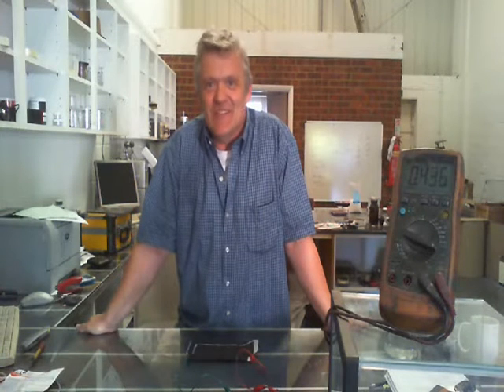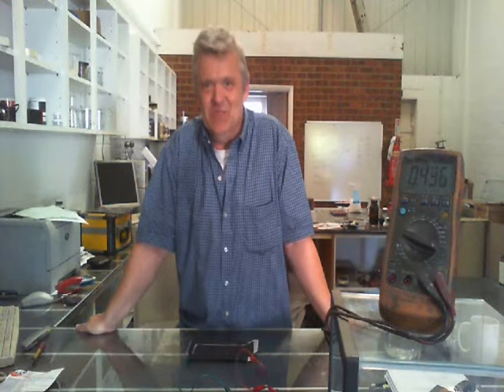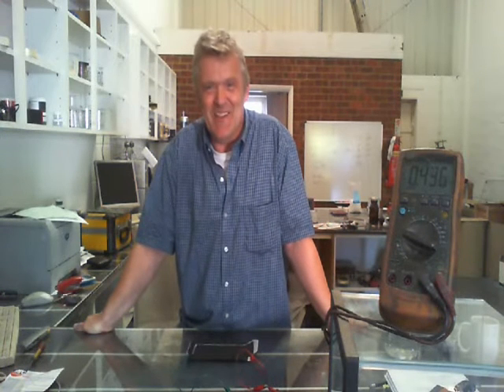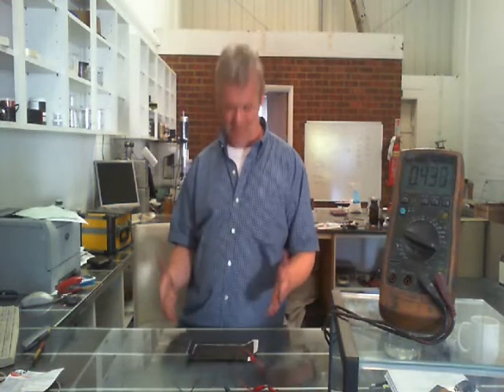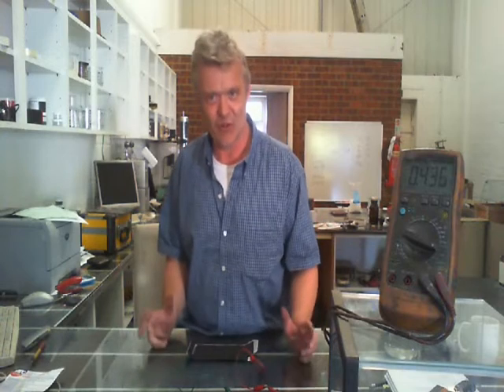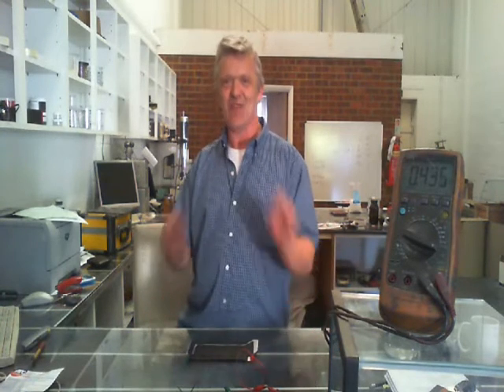That's mad. There's no separator in there. That's two layers of carbon straight on top of each other — different kinds of carbon — slightly dampened with an electrolyte, and it's generating 0.436 volts. Anybody get any ideas? I haven't. I mean, what is going on in there? But how fascinating is that? We can actually construct an all-carbon battery without a separator.